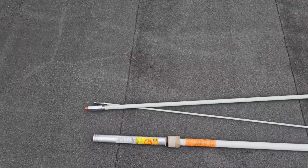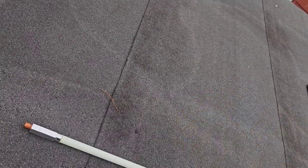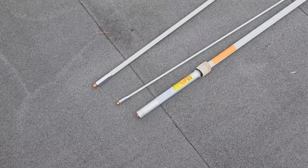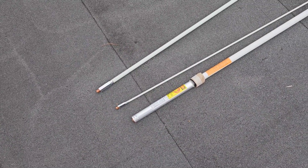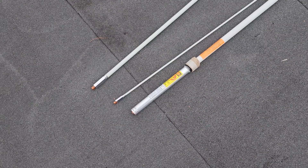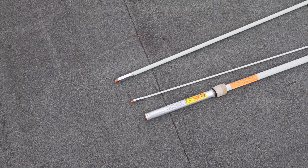One tip I like to do when I put together these screw-type antennas: copper clad never-seize. It makes a nice electrical connection. Put a little bit there, a little bit there, and I also do the connector at the bottom — but not in the center part, obviously, since that's electrically connected. It does help on the threads, keeps them nice. I don't tape my connections to try and seal out water — this seems to act as a pretty good sealant as long as your coax is hanging straight up and down. I've had antennas up for several years like that and they come apart nice and easy. It also helps with dissimilar metals.